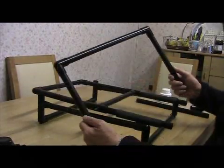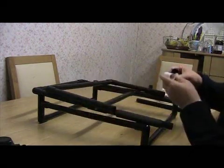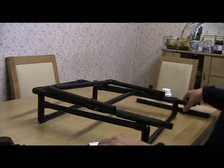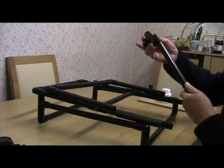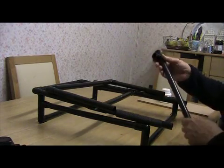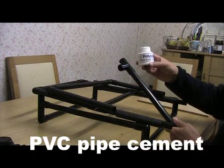You can see it's just got two bends — that's a 90 degree bend. This is all made with either the bands, which are that shape, and T-shaped pieces. There are no other components apart from those two. This plastic tubing is made so that it just pushes in — here's a piece of pipe, just push it in and it's fixed. Once you've constructed the whole thing and are sure it's all working, you can glue it together using a special poly pipe solvent cement.